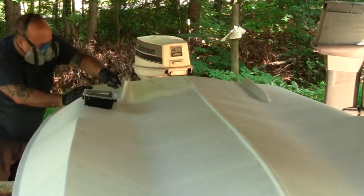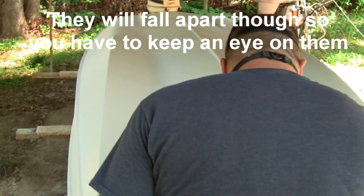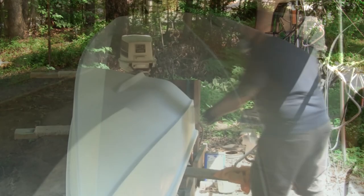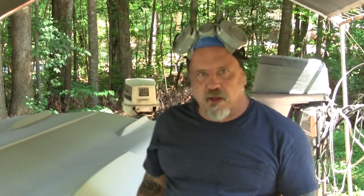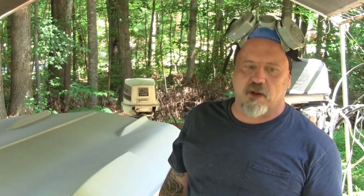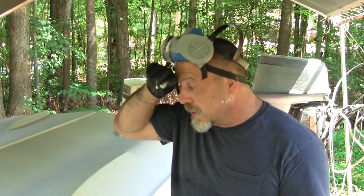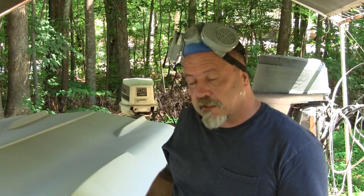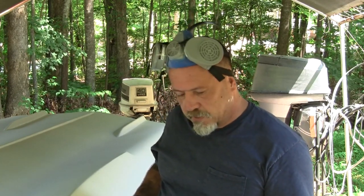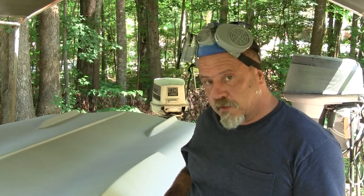After the last coat cured, I mixed up another batch and applied it using a foam roller - just a common foam roller you'd get at Home Depot or Lowe's. I find these a lot easier to use. I want to make sure we have a really solid barrier coat before putting the Interlux Perfection on. We're done with the second coat of primer - really it's the third, since the first was that gray coat which highlighted defects. Then two coats of TotalBoat TotalProtect white. Great thing is none of the spider cracks are showing through. Next is a light sanding, probably 120 grit, to rough it up and take down any bumps or bugs.